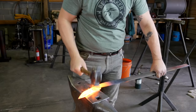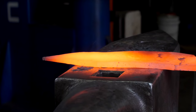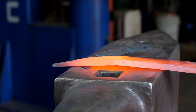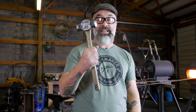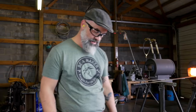I'm forging in one spot — I'm moving the steel. I'm not chasing this all over the place. The steel is going to move because I'm hammering on it, but I'm trying to just have it in one spot. The idea is I'm hitting one spot, moving the steel. The steel is going to want to slide around; I'm pinching it — it's rectangular, so when I hit one side it wants to move away from me. Hit it as hard as you can accurately. The way you develop accuracy is one spot, one spot, one spot.